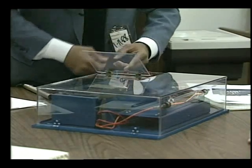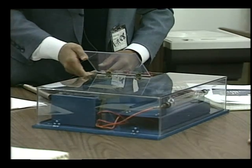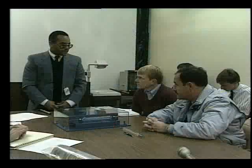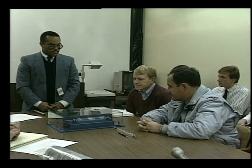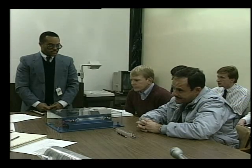You'll maintain this for approximately 20 seconds and that will raise the temperature of the wire up to 882 degrees centigrade. So we just need to get it above 800 degrees. That's why the wires are the length they are — they were calculated to carry the current and create that temperature.